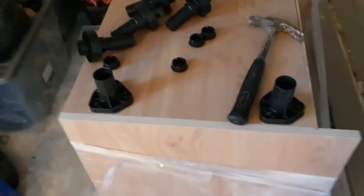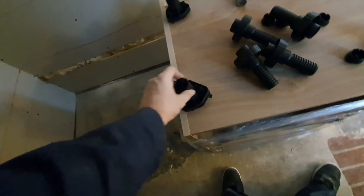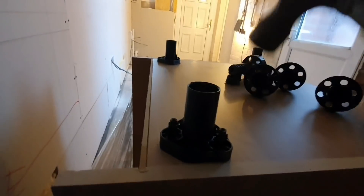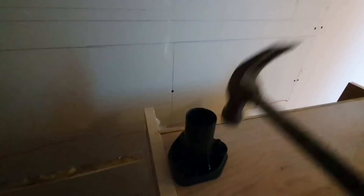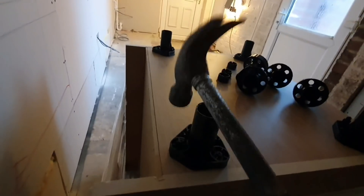When you're going to fit the kitchen, the first thing to do is open up your first unit. Inside you'll find a bag with the feet. There are two parts - the first part goes in, you slip it into the holes, push it down. These little sections on the Howdens kitchen stick up, and you bash them down so they fix into the unit.